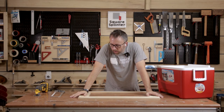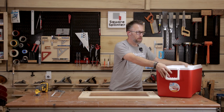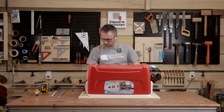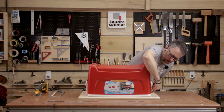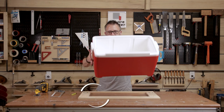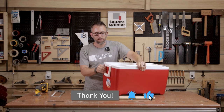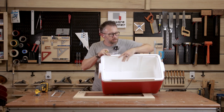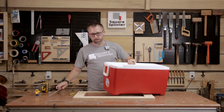The time has come to cut out the space for the cooler — arguably one of the trickier parts, but it's not too bad. All we need is our cooler with the lid taken off, to just carefully place it centered on this frame about the best that you can. Then run your pencil against the cooler as close as you want it to be and draw a line around the edge — easy as that. On my coolers, because I want a more finished look, I not only take the handles off but cut right along the rim so it's a continuous same size all the way around and the insert is smooth. That's completely optional.